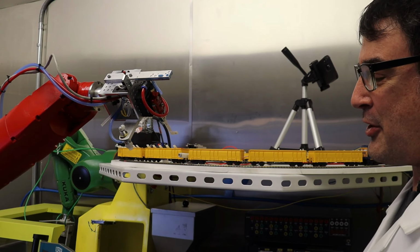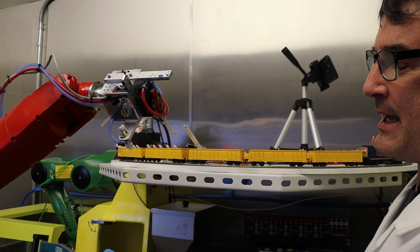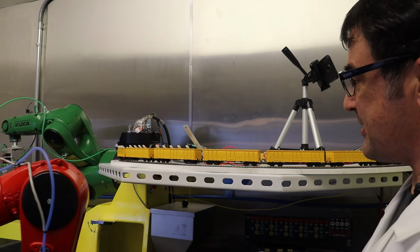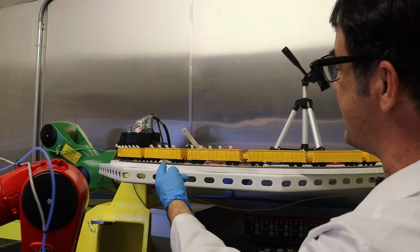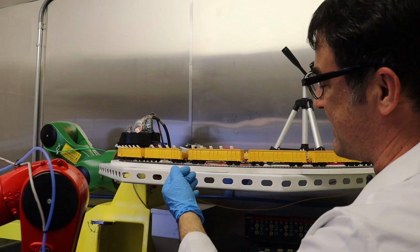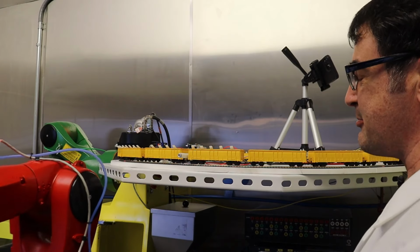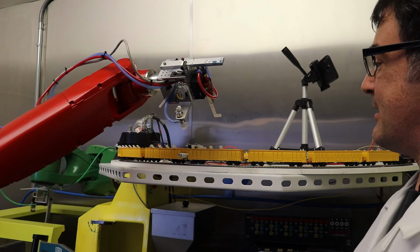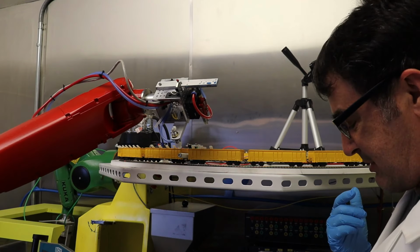I just decided to have a home position somewhere in this loop, because I think the robot likes to reset its encoders at the home position. I could be wrong about that. But here we're peak searching again, and as we get further into the line of cars, this back and forth peak searching is gonna be more prevalent. And I basically just said move forward until the signal breaks, move back until the signal breaks, and then repeat, and then wait like half a second so it allows the car to settle before it switches polarity.